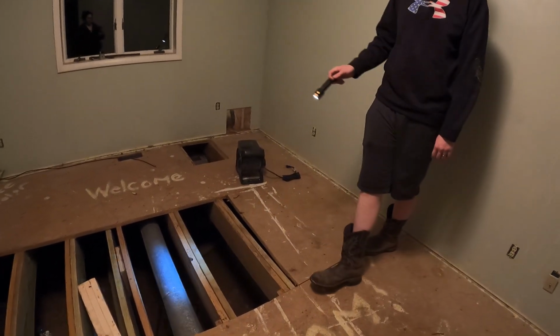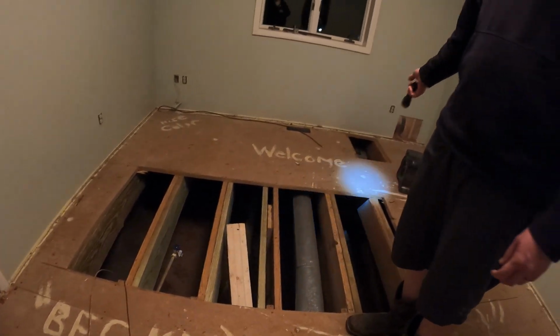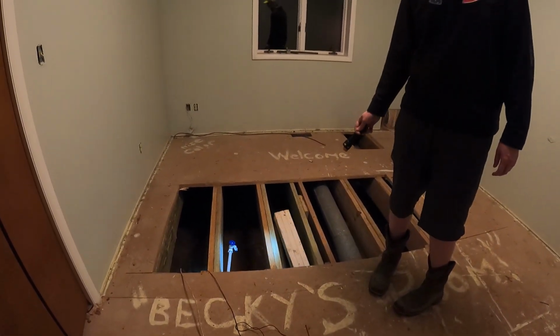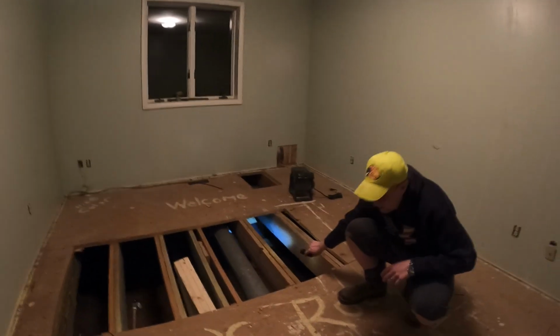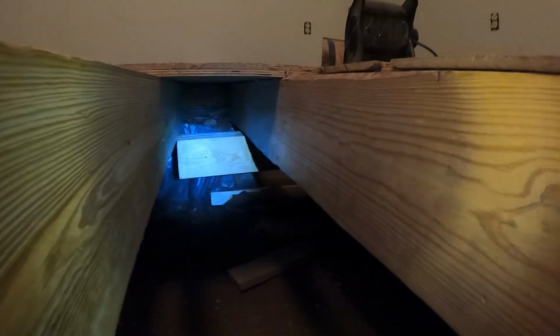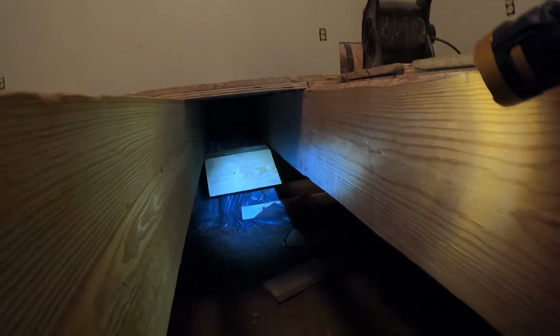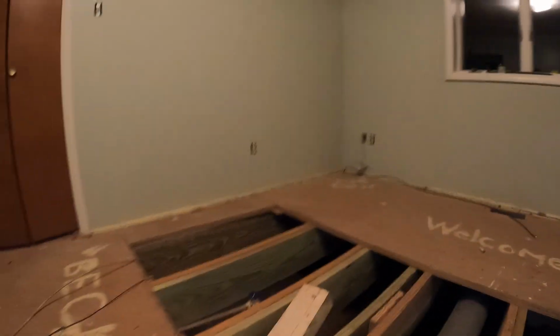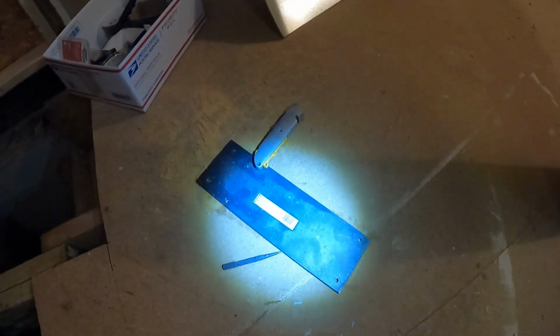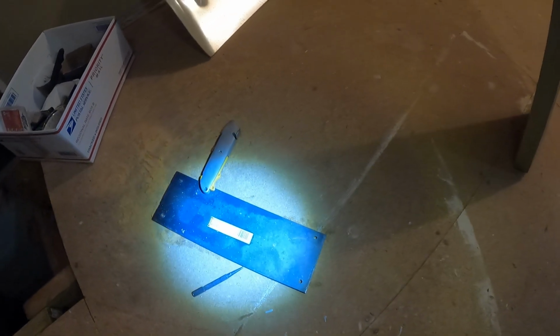So my plan for tomorrow is to take this, we also made some 2x8 beams. So this is what I started with. It's 3 2x4s nailed together. So now I have, you can see them down there. So you can see it, that's 3 2x8s put together, which is the same as the actual beam. So now we don't have any flex problems. And there's also one of these steel plates, a 1/4 inch steel plate under each one. So the jack has a place to push up, because that was another problem we were having, as it was just cutting into the wood.